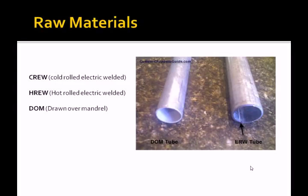For components like lugs and forward control adapters, the slightly more expensive seamless steel known as drawn-over mandrel, or DOM, will be needed. DOM can be used throughout the chassis, but it pushes the price unnecessarily high. There are various tubing diameters you can use safely, though most bikes are built from between 1.2 to 1.25-inch diameter CREW, with a wall thickness of between 0.095 and 0.120-inch.